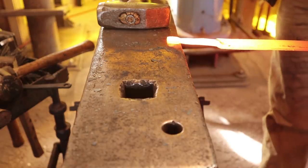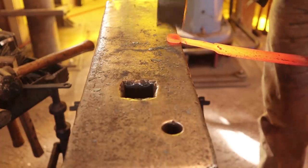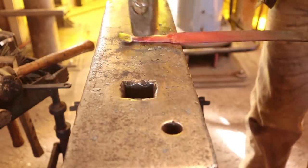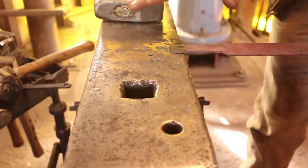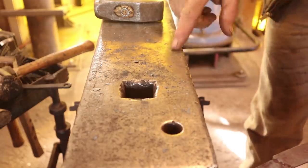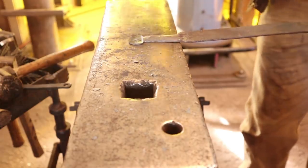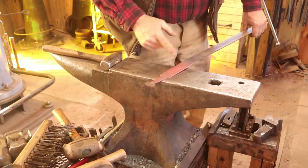Good side down with half face blows at the edge of the anvil — I'll start with the cross peen. I work to one side, then I work to the other side, then I change to the face and clean all that up. You'll notice this is not straight with the anvil, and that's because my anvil actually has a crown in it here. If I come level, I don't actually get a step because it's up over the edge where it starts to drop off — that's a result of this having been repaired with welding at one point, which seems to have softened it. Both sides of my anvil now drop off; it needs to be redressed, or maybe I'll just get a new anvil one of these days. That's really all there is to that for now. I'll let it cool, then we'll cut it off and roll up the eye for the joint.